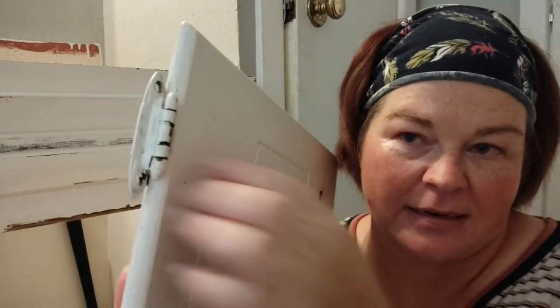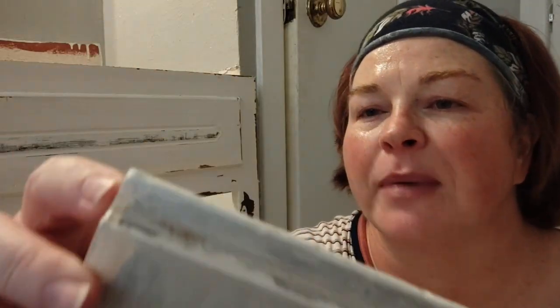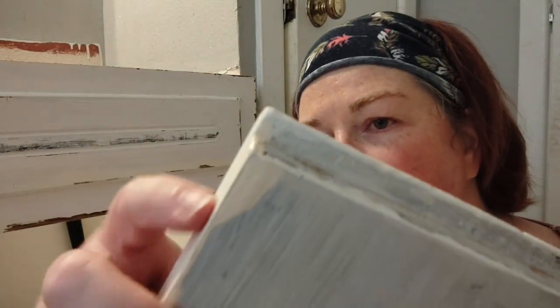And then the doors, I'm taking outside, pulling these off. I'm going to clean up the hinges. If I'm doing this, I might as well go ahead and do it right. I'm going to wash or soak the hinges in hot vinegar in that mixture, and that'll loosen up the paint, and then I can get the paint off. And then I'm going to scrape so I can get these thick layers of paint and all these globs off, and then sand, and then I'll be ready to repaint.